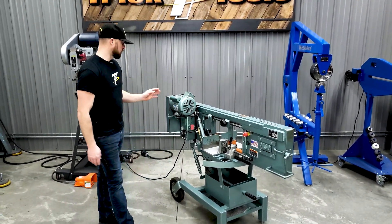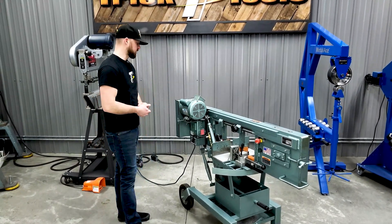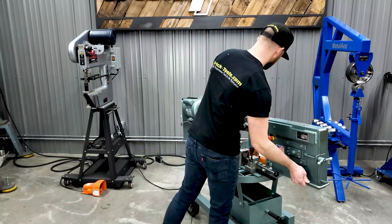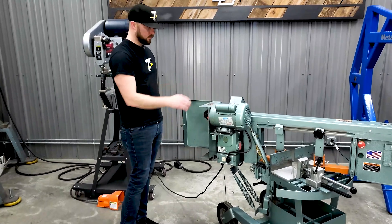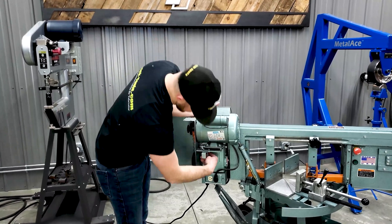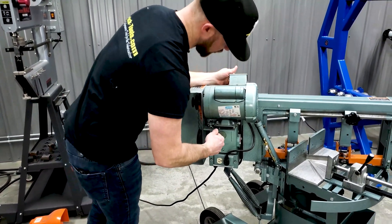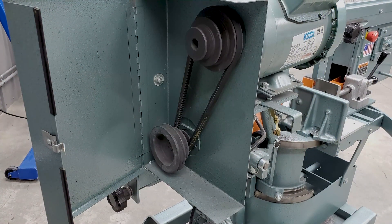It is built with a 110 motor. You can get an optional 220 motor, but really the 110 has got all the power you're going to need. It is variable speed — there's a little door on the back that you can open, which has a couple of different grooves for the V-belt. You basically loosen up the little eye bolt, pop in the little lever, loosen the belt, put some tension back on the motor, pull the tab out, tighten up that eye bolt, and it locks it in place, keeping tension on your belt.